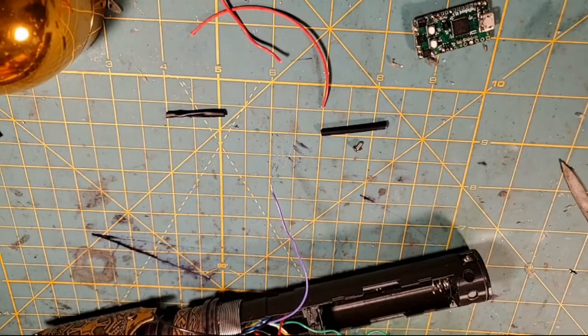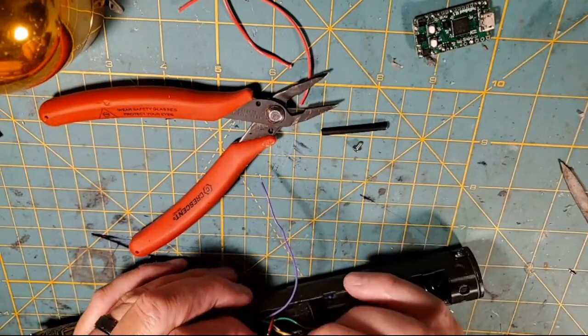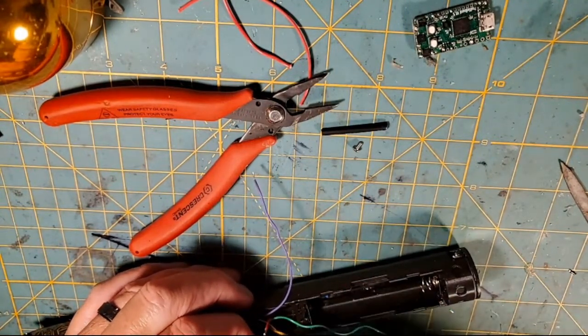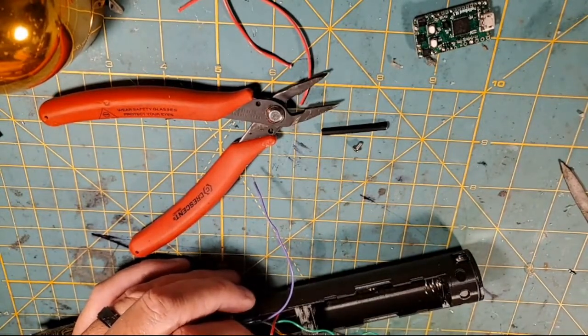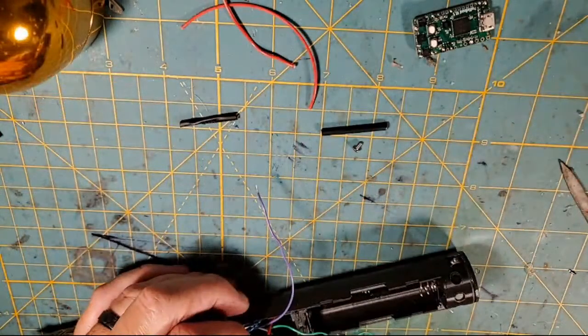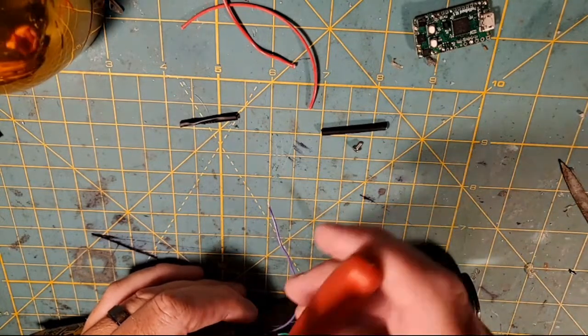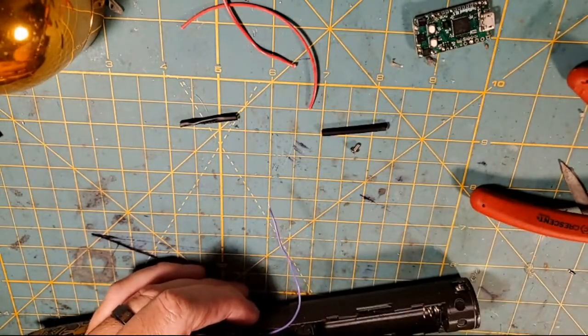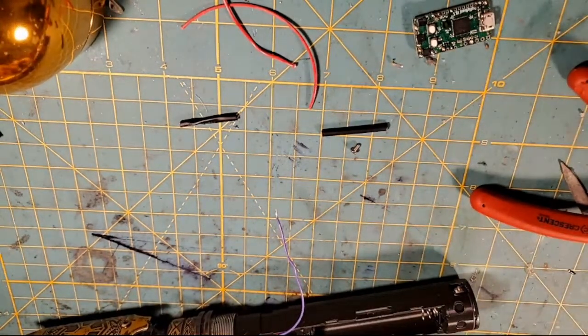So I'm basically merging the positive NeoPixel from the NeoPixel adapter to the positive battery terminal that we just soldered. And I'm also going to add in this little 26 gauge pigtail that's going to feed up into the Proffie. You don't need to use 22 on the power on Proffie on positive. You're going to stay twisted. You're going to go in the hole. Just like that. So this is our 26 gauge and the NeoPixel line coming down from the NeoPixel adapter.